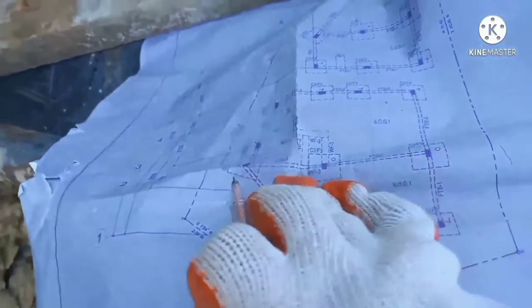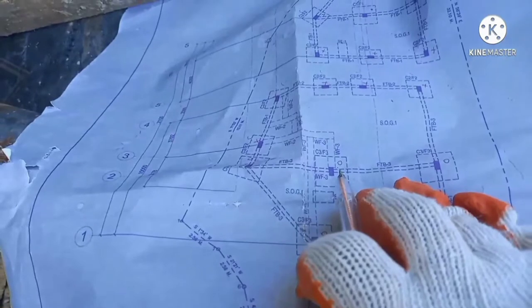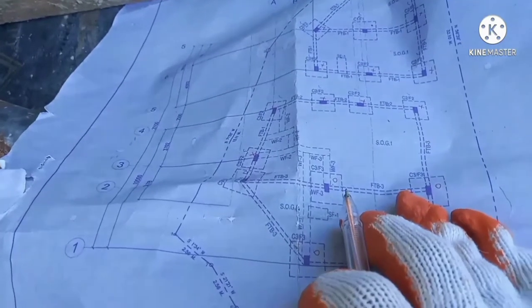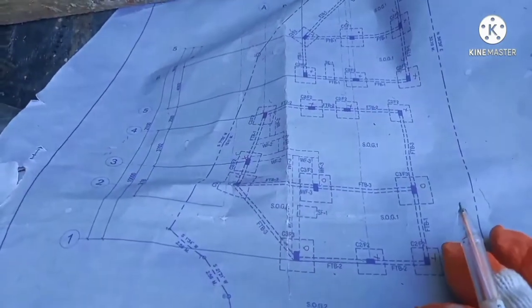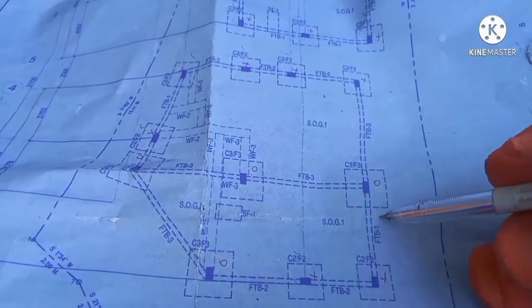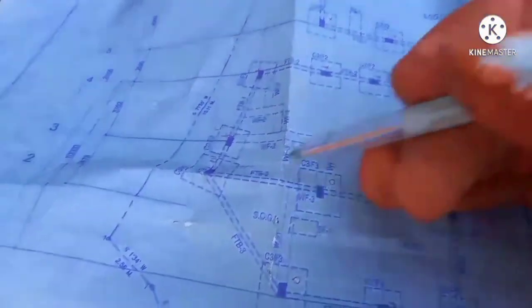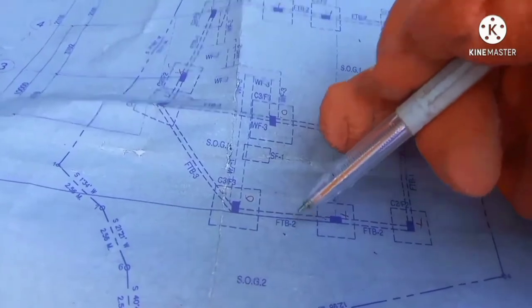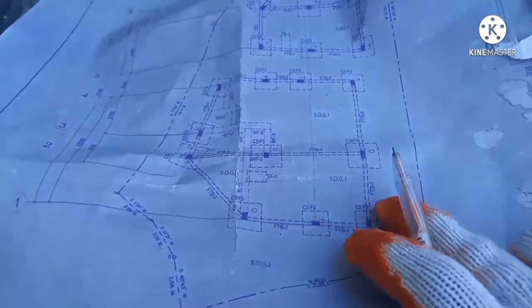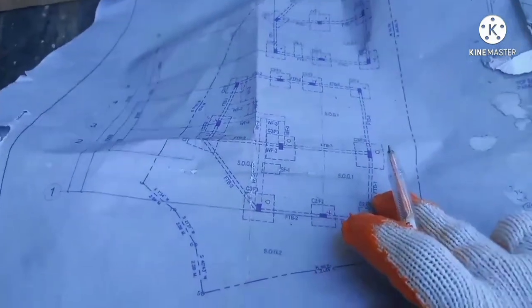This is the middle section, mga katigma. It passes through. Some of you are probably wondering where you can see the details of the rebar to be placed in this tie beam — how many stirrups to place. You can see there is a marking written here: FPTB, which stands for Footing Tie Beam 1. You can also see FPTB3 — that's Footing Tie Beam 3 — and FPTB2 for others. These are visible in the foundation plan, and the details are found in the schedule of footing tie beams.